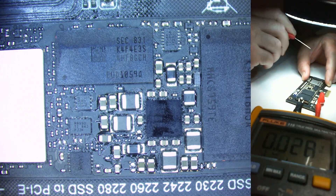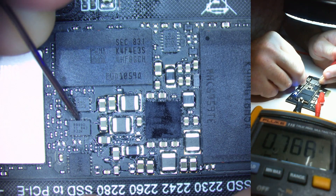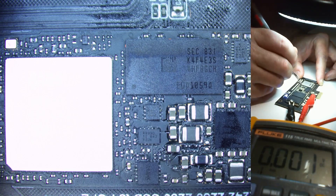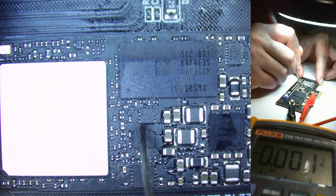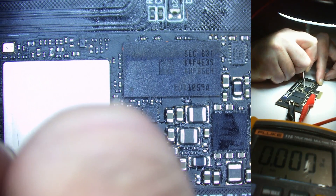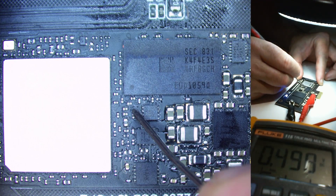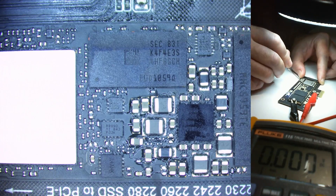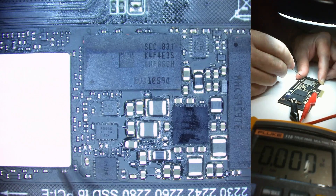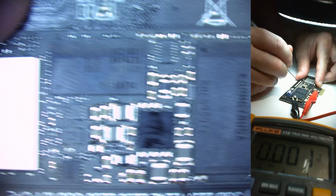There's a 5.5 volt out and possibly other pins here — I think this is a Texas Instruments chip. I'm seeing 0.8 volts on a couple of pins; not sure if that's ground without the data sheet. Going up to the next little load switch — if that's pin one then this would be the input side; they look like they're paired. We're getting about 1 volt. Samsung doesn't really publish data sheets for this because they have a completely vertical business model — they make and sell these products and don't release them for third-party vendors to use, so you can't get many data sheets for Samsung technologies.